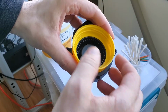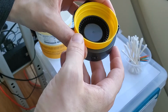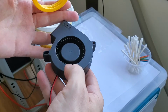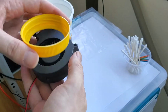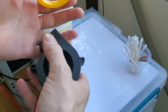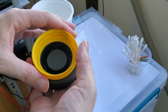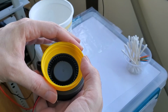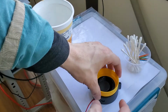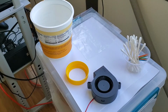Since the surfaces are rigid, they're not easily flexed. That is, they don't bend from their shape unless you apply a lot of force. This should work with a glue that dries relatively brittle, which means it breaks when bent, such as epoxy. The epoxy should make a much stronger connection than the silicone caulk. So I'm still going to put a little bit of caulk around the very edge just to assure that it's airtight.